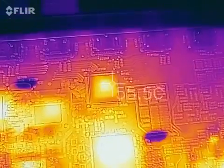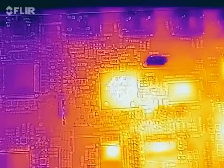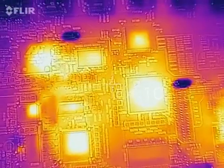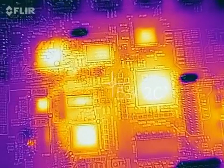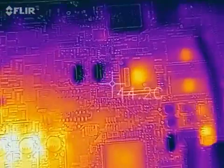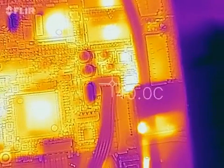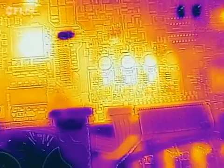The chip behind it isn't too bad, but these chips here really do need a heatsink or some airflow over them. My plan is to fit heatsinks — certainly to that big one, the one at the bottom, and the one to the left. I'll put something on the DTS chip as well, because that's the one prone to failure. For the small ones I'm not sure, so I'll probably just install a couple of fans over the top to keep everything cool.